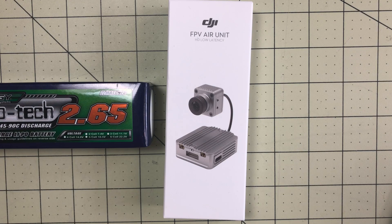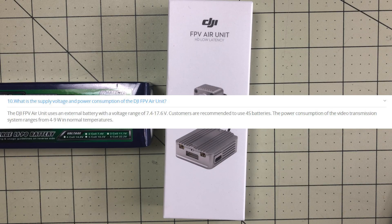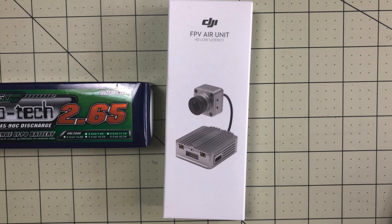Some flight controllers or ESCs will have a 9, 10, or 12 volt pad — you see a lot depending on the model. It's usually intended for hooking up your camera or VTX at a higher voltage, because 5 volts can cause problems when it's that low. If you have one of those pads, check your manual to see how many amps it can support. For example, here is a flight controller that supports 10 volts at 1.2 amps. The amp draw on this unit is fairly small, so 1.2 to 1.5 amps on a 10 volt circuit will work. But some models have nothing — everything is voltage in, voltage out.